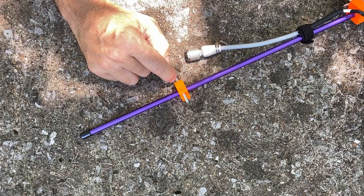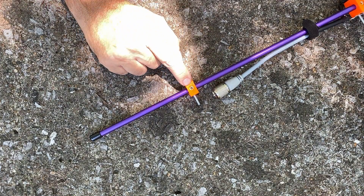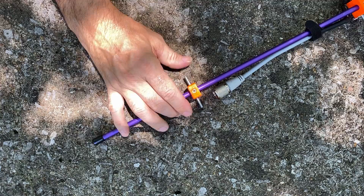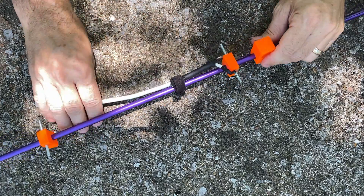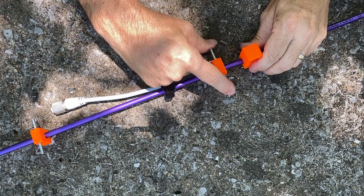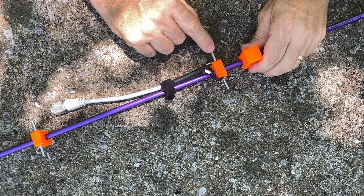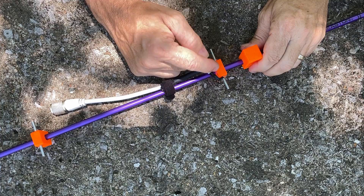This one does pass all the way through so we have continuity across both sides. In each of these I have put one of the little metal inserts — you insert these with a soldering iron and a special tip — and that allowed me to get a set screw in there to keep this thing tight against the main boom shaft. Now the one in the center for the driven element is a bit different because you don't want continuity between both sides, so this actually has some plastic printed in the middle, and the element screws only go in part of the way.